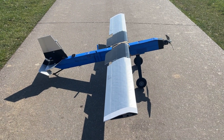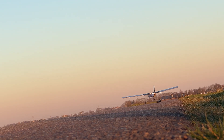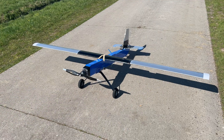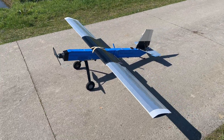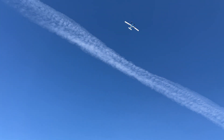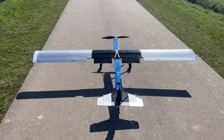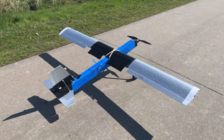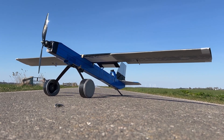This is my latest fixed wing design, a purpose-built FPV trainer designed for short takeoff and landing practice under FPV and payload weight experiments. With a wingspan of 2.2 meters and an all-up weight of approximately 3.2 kilograms without the FPV, this RC craft is heavy in relation to my other builds which are about half its weight. For this reason, I kept the airframe design simple and went for the conventional tail tractor configuration for solid flight stability and easy control for effortless practice under FPV.